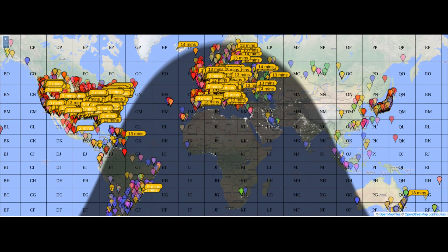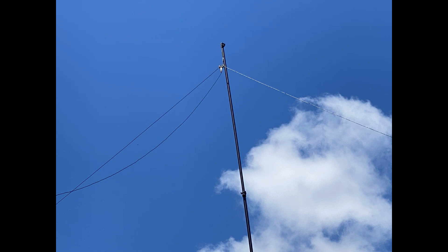With the two chokes in place we're doing a pretty good job of reducing the noise floor and keeping RFI or feedback out, and I'm pretty happy with that. Here you can see the PSK reporter map after about 15 minutes of FT8 — it was a pretty productive session. My signal was heard pretty well all across North America, Europe, a couple down in South America, and one over on the coast of Australia. The QRPGuys kit was a fun project and I think I learned a thing or two putting it together. While I understand there are some limitations to this antenna — mainly the power level — I'm glad I put it together. That's going to wrap this one up. If you have any questions, comments, suggestions, or recommendations, post them below and I'll do my best to respond. Thanks for watching.